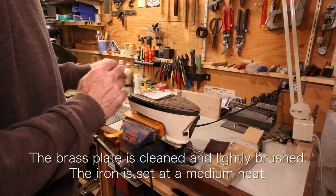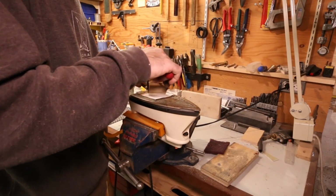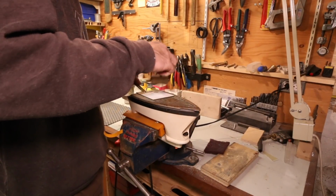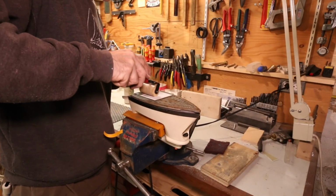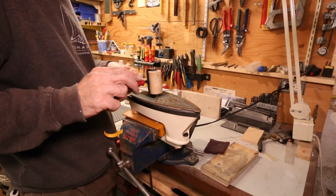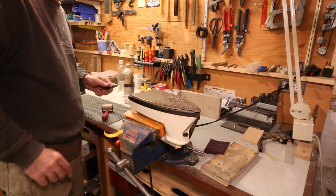Now this is the important part. We're going to use a little rubber printer's brayer. And the trick is to get this rolled down without moving it around. It's kind of gluing itself down here. Some modest pressure with the roller just to try and push that toner down onto the plate. So now I just take this off and I put it down somewhere else to cool. I let that fully cool before I mess with it.